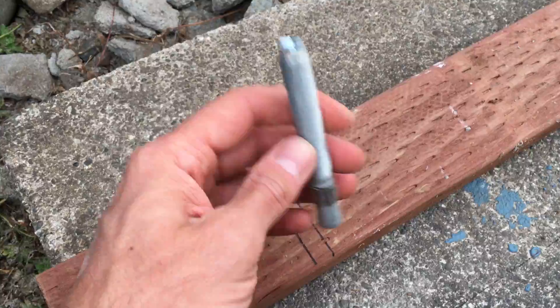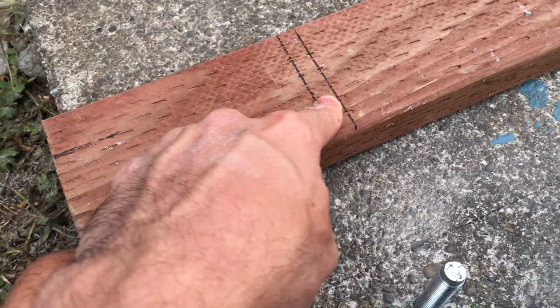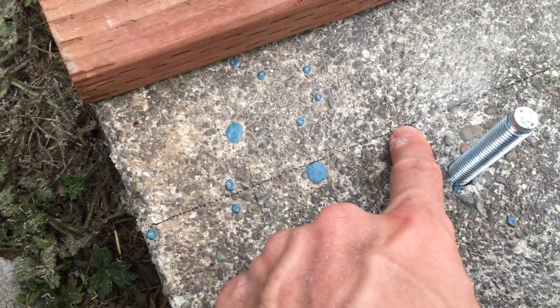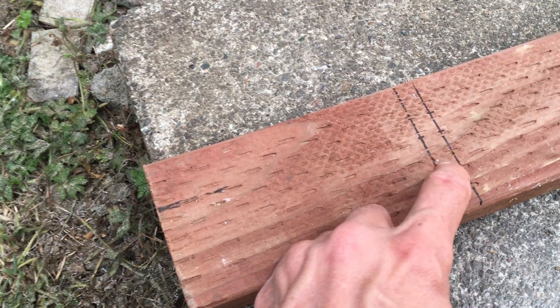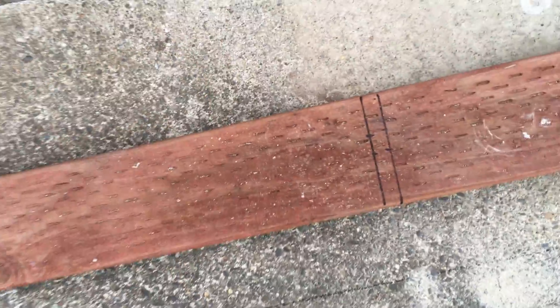To find the appropriate places to drill the holes, I just lined this up with a square and moved along it so I know it's going to be in between there. Then I measured from the line to the front part of the bolt and the line to the back part of the bolt, and I got little places lined out where I'm going to drill — right in that little box right there, and the same here.